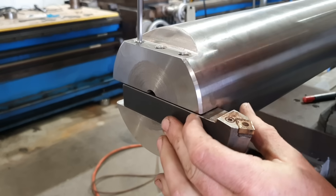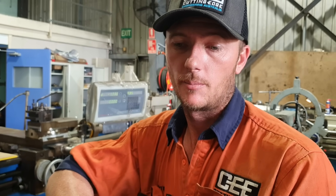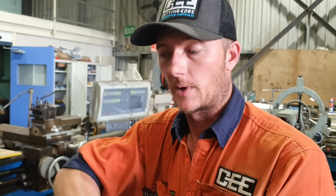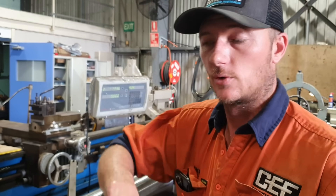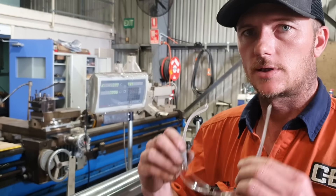What we're going to do now is change the tool out to an SNMG neutral. I want to see what sort of surface finish I can get in here by taking a very light cut. I might increase the RPM but I will keep the feed rate at 0.25mm per rev — we're not going for any massive depth here, we're just going to see what sort of surface finish we can achieve on a bar that's hanging 600mm out of the tool post. We've got the tool in there now, let's start machining and see what happens.